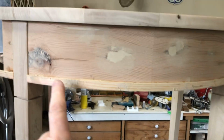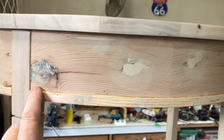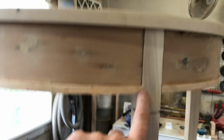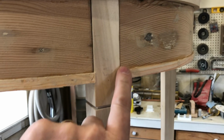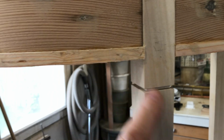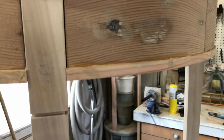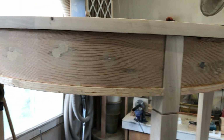All right, I know I said I would do this in the next video, but I just couldn't help myself. I was this close, I thought I gotta put it on. So I used the blowtorch and my little pipe, using the luthier trick to bend this little piece of wood, little piece of pine, and tacked that on, well, glued and tacked it on and put some filler over the little nail holes. So tomorrow I'll be sanding that down, sanding everything and getting ready for some primer. But really pleased with the result, everyone.